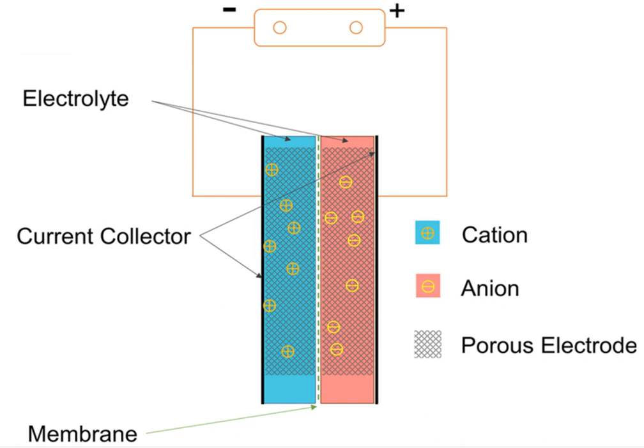The same static storage also applies for electrolytic capacitors, in which most of the potential decreases over the anode's thin oxide layer. The somewhat resistive liquid electrolyte cathode accounts for a small decrease of potential for wet electrolytic capacitors, while for electrolytic capacitors with solid conductive polymer electrolyte this voltage drop is negligible.